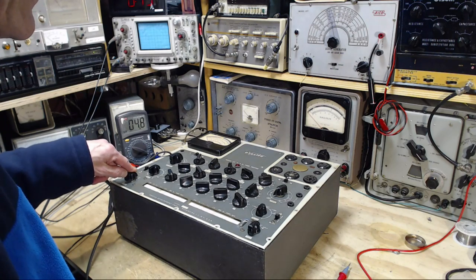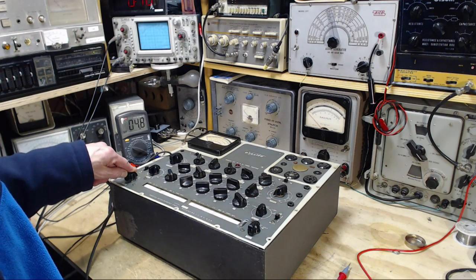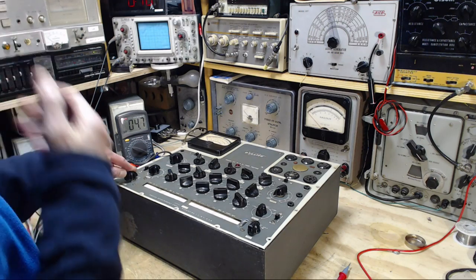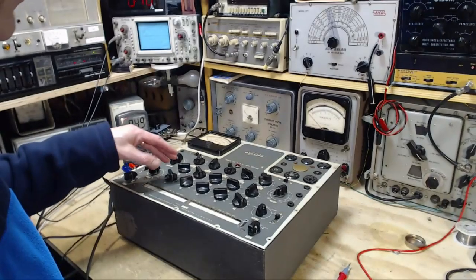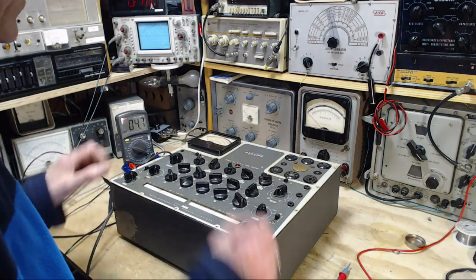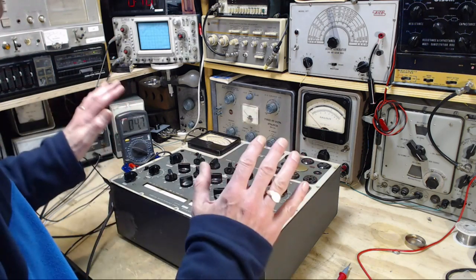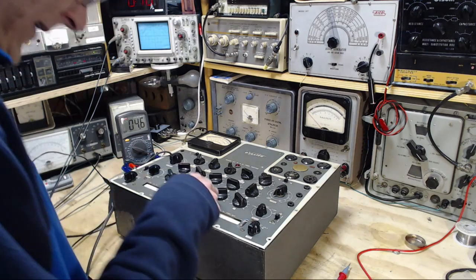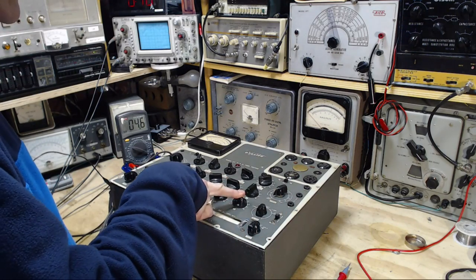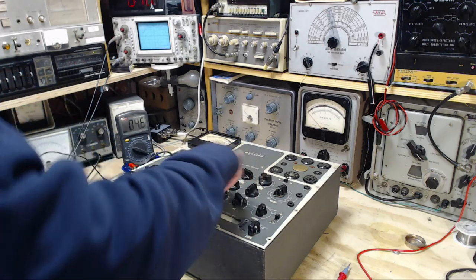Set it back where it's supposed to be. Roughly. A few other switches here to throw. I have it set up in a bit of an unusual mode right now, in which, instead of the tube tester just energizing the tube, some of the energy can be directed through to these terminals. And then you can either make current measurements or voltage measurements off these terminals. This tester has an unusual way of doing it. It has what's called a connect line in it. The connect line, as I understand it, is a wire which attaches to number 8 on every one of these controls. I'm not 100% sure of this, but this is what I think it is. And two of these controls have nothing to do with the vacuum tube. These two controls are hooked up to this grid terminal and the plate terminal. So you're selecting with these controls what goes on these terminals.